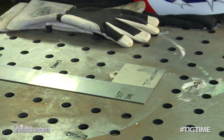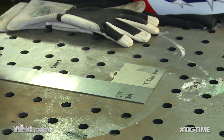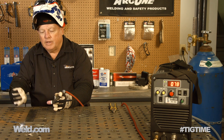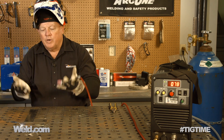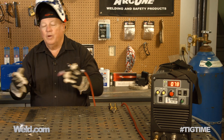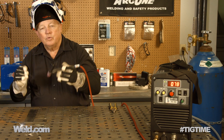I've got the two pieces set up — I've got the titanium here and the stainless here. I'm using a titanium filler material, and then a little bit later I'll change fillers and show you why. I'm going to go ahead and just make a weld and mix the two, dab filler. I'm not worried about gas backup. This material has pretty high tensile strength, so if I get any kind of a weld, there's no way I'm going to be able to break it apart. I'm just going to show you the two and how they mix.